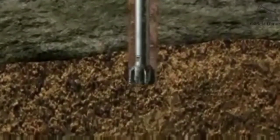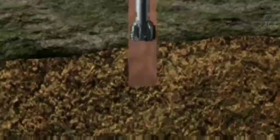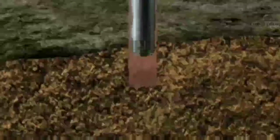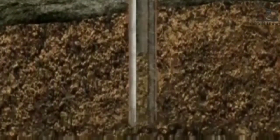When the well penetrates a potential reservoir rock, the oil or gas may be detected by analyzing the drilling cuttings for traces of gas and or oil. At this stage, it is essential to gather as much information as possible about the reservoir. In the first method, the drill bit is replaced with a diamond-studded coring bit at the bottom of a core barrel, which can cut a complete section of the reservoir rock and return it to surface for detailed analysis.